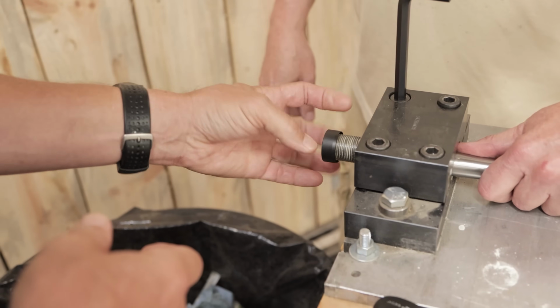All we did was we took a case and used that for measurement. And what we were after in this case, since we reused the nut, is setting headspace with the nut like on a Savage or, in this case, Ruger American. You have some adjustability there. So in those systems, the factories have figured out we just headspace to a certain depth. And so that's what we were looking for, is what does the factory set it to?